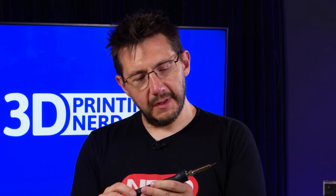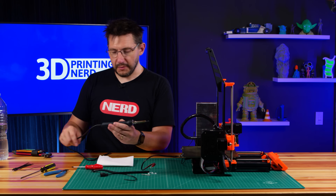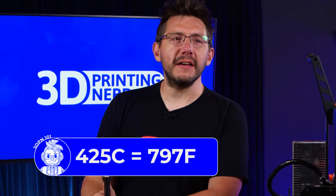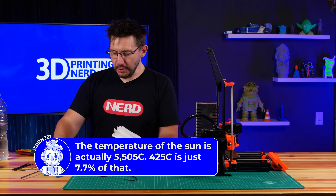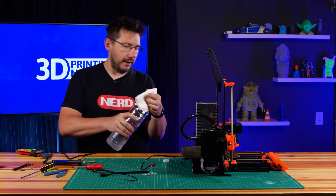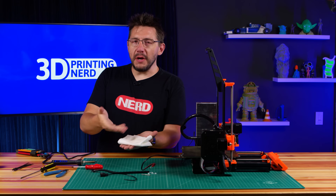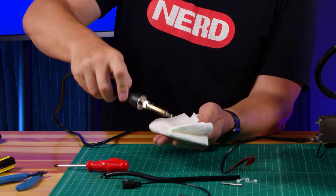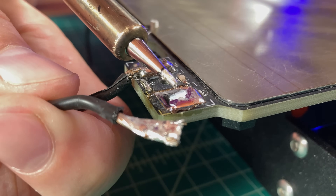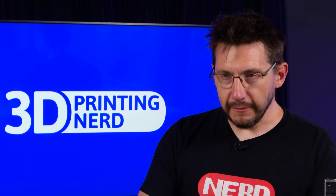This soldering iron is from Beka, I think I got it on Amazon. It goes up to very high temperatures but has presets so it's digital — I can set it to 425 degrees Fahrenheit. I also have a paper towel soaked with water to act as a sponge to drag the tip across to clean it. You can see it heat the solder to the point of liquidity and I remove it. I've left both pads full of solder and I can clean the tip like that. Just know that you're dealing with something hot enough to burn you, so be careful.